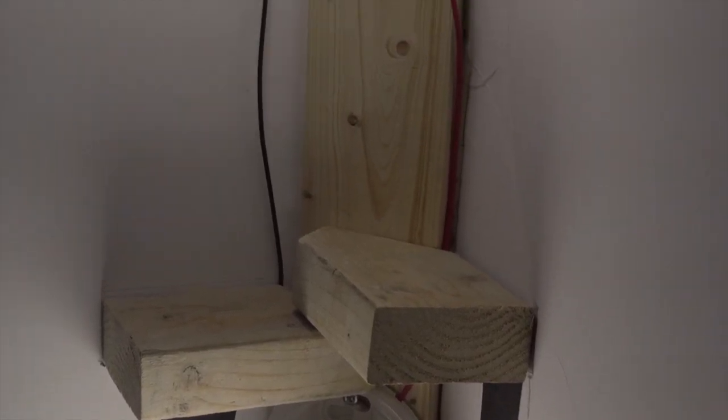I'm standing in front of a background which is lit by two DIY lights, one on either side. Originally I was going to make two lights and go horizontally, one on top and one on the bottom. But instead I decided to split one of them in two and go vertical, one on each side. As you can see, we've got a nice even light wash. The foam board here keeps the light going to the background and away from me. Now if I wanted side light, I could have left the foam core off the side, but in this case I didn't. Keep in mind, I'm not an electrician — build this light at your own risk. Read a book on wiring. If you don't understand the basics, don't build it. Don't be careless. Do your homework. So there you go — a $67 poor man's KinoFlow. And by the way, this light is 18% more powerful at one-tenth the cost. Woo-hoo!